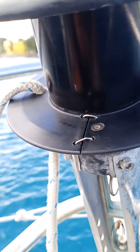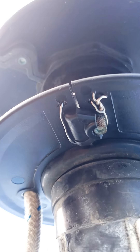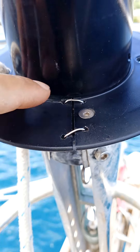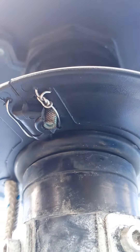Back to the fix — I just want to show what I did as a quick road fix. Because this plastic piece broke, as you can see, I simply drilled four holes and sewed it together with stainless steel annealing wire. This is an improvised solution so it hasn't stood the test of time yet. I will be sailing from here to the Philippines, so I'm crossing my fingers. I hope it works and I hope I've helped out some fellow sailors out there. Cheers!